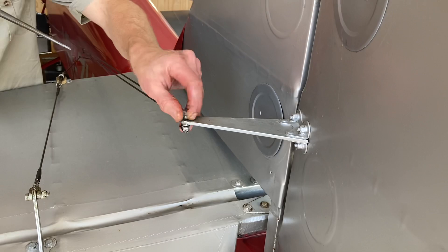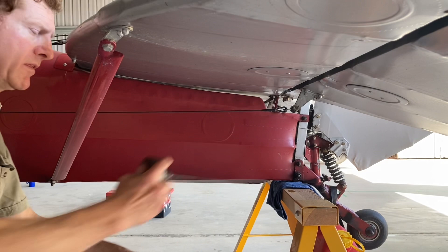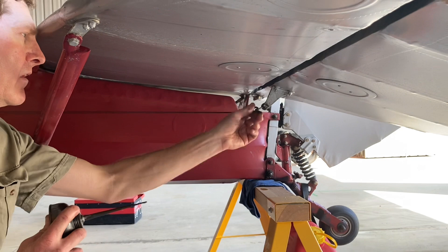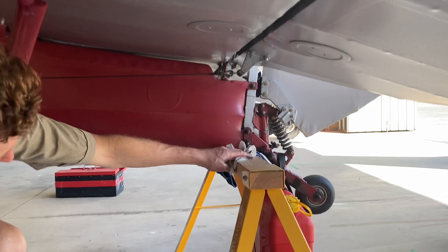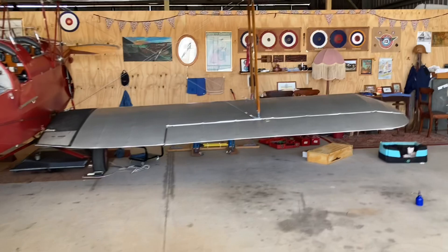It's a bit like a relationship — you've got to maintain it all the time. I tend to do this every two to three months. There's always wear and tear, vibrations, usage, and the air blows the oil away. So we try to start at one end and work our way around so we don't miss anything, and if you do notice something come back to it — don't wish it away. We're going to do the other side and then move to the forward end for greasing the Tiger.